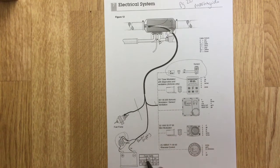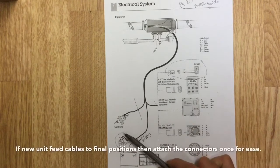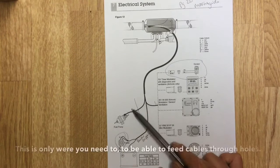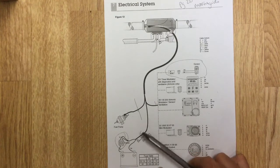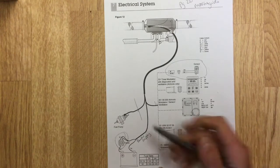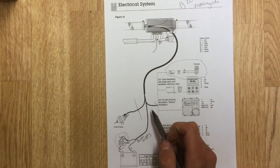Just got to get to the outside — we'll have a look at how to do that. And that's it, it's a pretty simple system. If your unit's new, you'll have to put the connector on yourself. If it's an older unit you'll have to cut and then rejoin your cables. If you are rejoining cables, it's best to solder them and put heat shrink over them so you get a good solid seal and it's not likely to get dirt and moisture in there. But you could just join them with crimps.